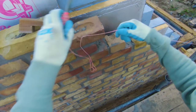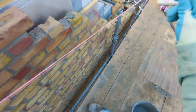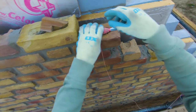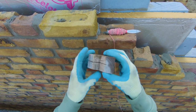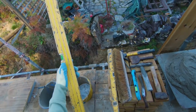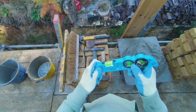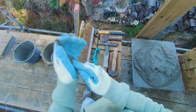Before we get going and start laying any bricks, let's go through what you're going to need. First off, a set of lines — I've already set these up on one end. Nice brick lines with a bit of stretch to them. One or two corner blocks — I'll show you how to make these in another video, very simple, just a piece of wood cut up. One or two depending on what corners you're on. Then a four-foot level, two-foot level, and a boat level just in case.